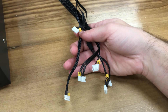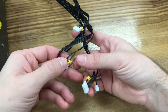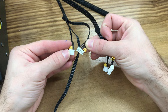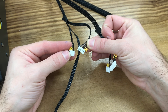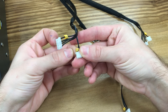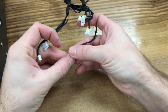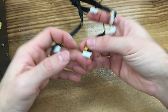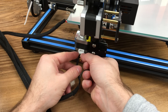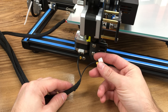At this point, what we are going to do is to connect the cables coming from our control unit. All the cables are marked with plastic labels — the smaller socket labeled X is the X limit switch, and the big socket labeled X is the X motor. This is the Z motor and this is the Z limit switch, Y motor and Y limit switch, and this is the motor for the extruder. Let's start connecting them. There is the Z axis socket right over here — get the Z axis connection inserted and this is done. Now we are going to connect the Z axis limit switch.